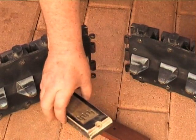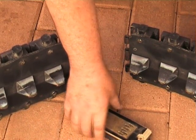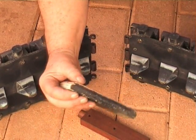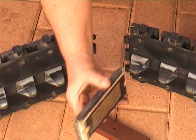The poly tube ring prevents the timber from splitting and wearing away against the drive sprocket. Onto the main core, the pad, we have our shoe. This has been cut from 19mm form ply. It's quite tough and is cheap.